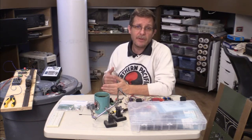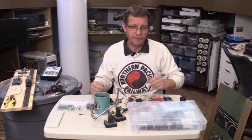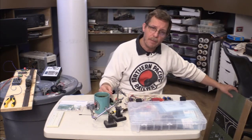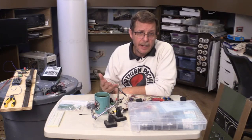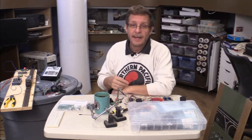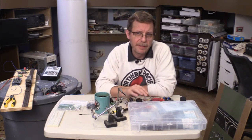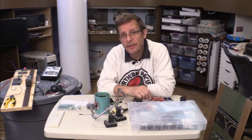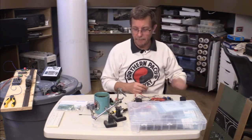JMRI is a panel design system. The Panel Pro is an example of a digital panel control system. The needs for the two of them are a little different. In the case of where we're dealing with what we're going to call a hard panel or an analog panel, I need to light up an LED somehow, or I need to light up a light bulb. That means I need between 4 to 12 volts roughly to light up something. And a lot of the designs that Jeff Bunza has put out in Model Railroad Hobbyist, matter of fact, I showed one in that first video, is designed to light up an LED. It's going to throw about 4 volts of power on the output signal, so you could stick it on your panel and light it up.